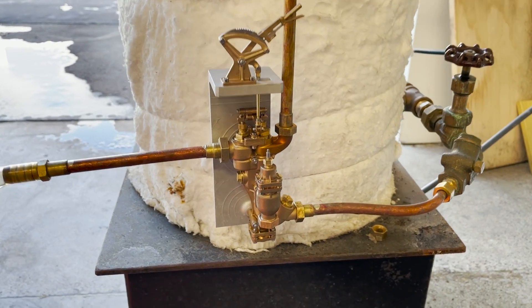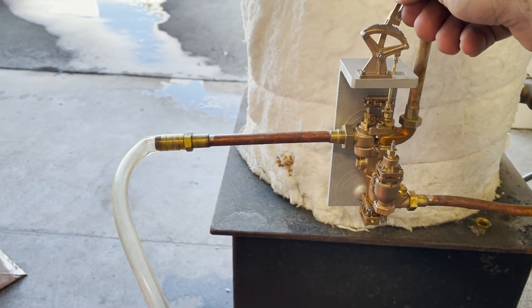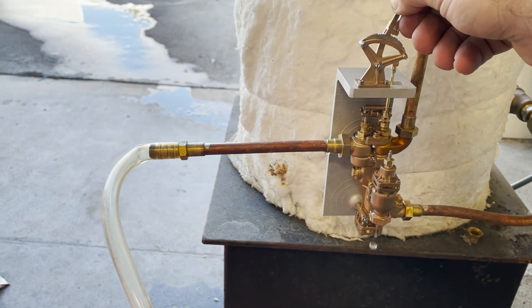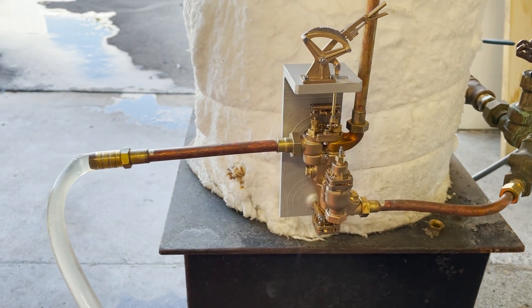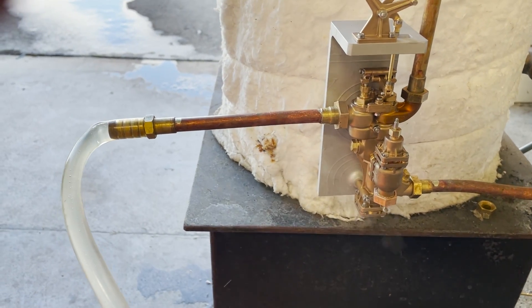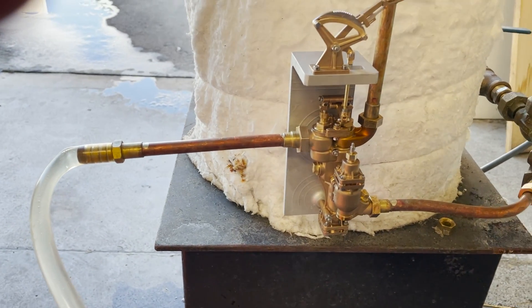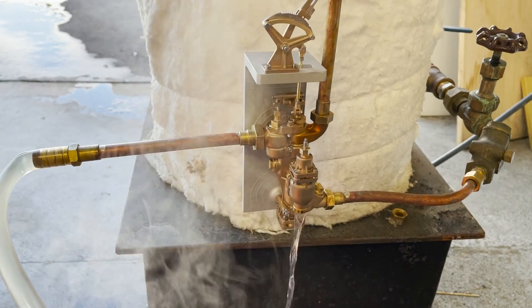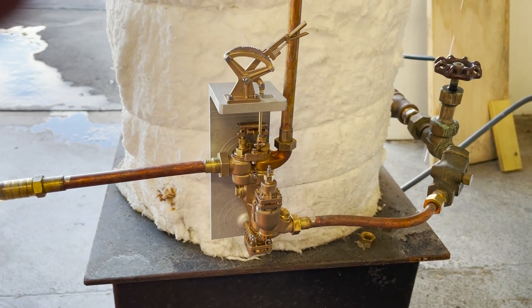I have the overflow capped off — I'm kicking steam back. It is very much overheated right now. Now let's take this off and just let that drop, because it's very hot. Now we'll put this in prime position and see how long it takes to pick up water again. Not very long at all — so the prime position is pretty bulletproof in my opinion.